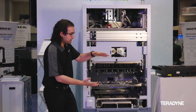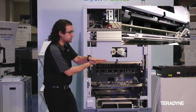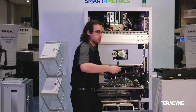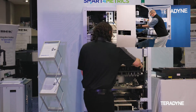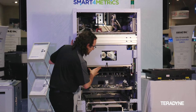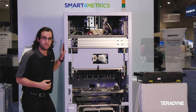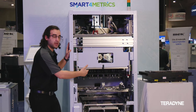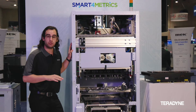The purpose of the press is to have a solid pressing between the two fixtures. We have the top fixture here, which is very easily loaded — you just take it and push it in all the way back. What's very nice about this system is that with the jig ID blocks in the back, once you load it in, the computer should recognize it as fixture ID 1 and load the programs for fixture ID 1, minimizing the human interaction needed.